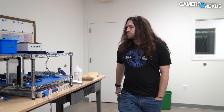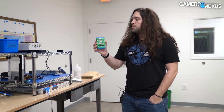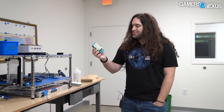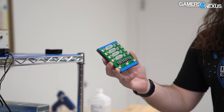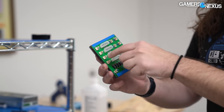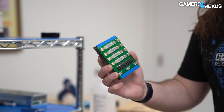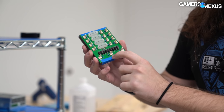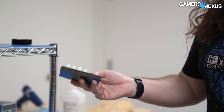Last couple things on the machine. This fan board — I love this thing. We bought it in Taiwan for about $9 US, and it was easily one of the best technology purchases I've ever made. It's just a fan power board. You plug in Molex and each Molex powers a line of headers — all three-pin, so it's just DC. There's 12 volts, 5 volts, 7.2 volts, 6 volt, 9 volt — this allows us to really easily control fan speeds for external projects.